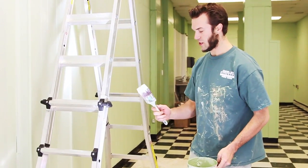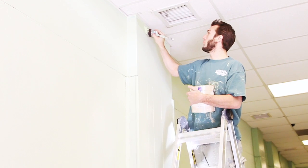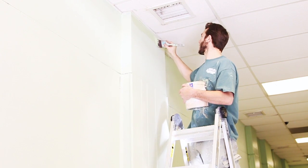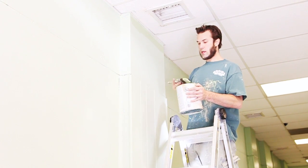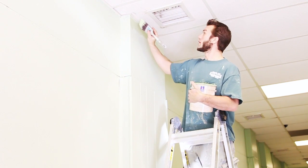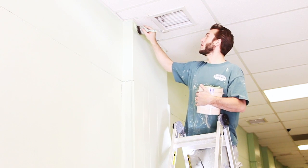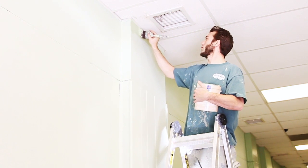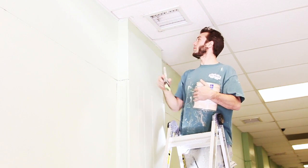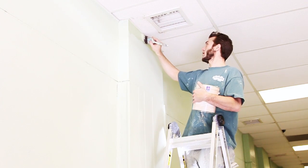I'm cutting here and I'm changing the hand over. Let the paint do the work. I've got what I call a bucket on the wall — I take some paint and throw it up on the wall, and that's what I paint out of. So cutting the line, I get inside of the paint and very sensitively fan it out. I've got these tiny little bristles and they're going to find the crack up in there. I just let the paintbrush do its thing — all inside the crack.